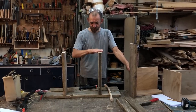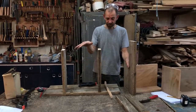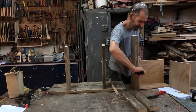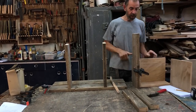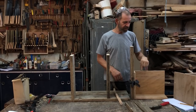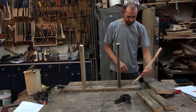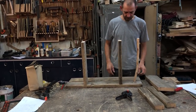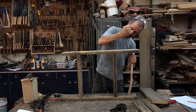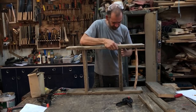So I've nailed these two shelves to this side and now I need to nail the other side on top. I use these jigs to hold the shelves and a pair of clips like this. If you want to know how to make this jig, there should be a video up here somewhere — click on that and there's a video on how to make these. If not, just go to my channel and you'll find it. Now I'm going to pop in the towel rail, put this side on, locate the towel rail, and make sure I'm on my mark before I drive in any more nails.